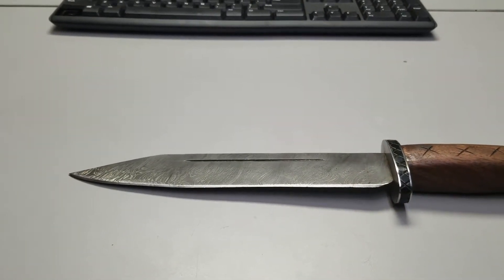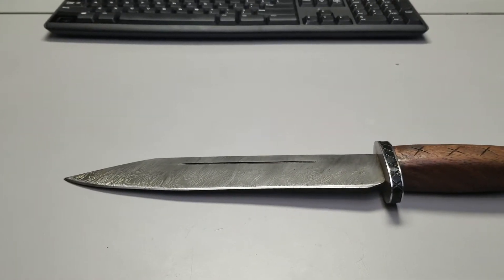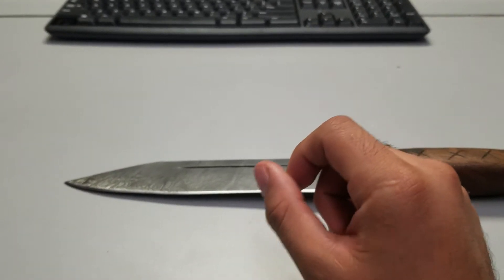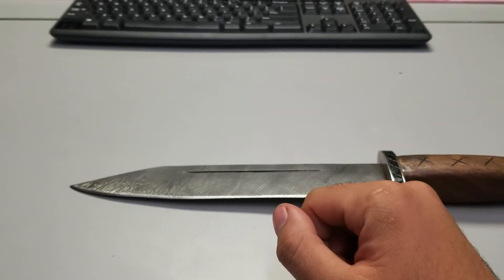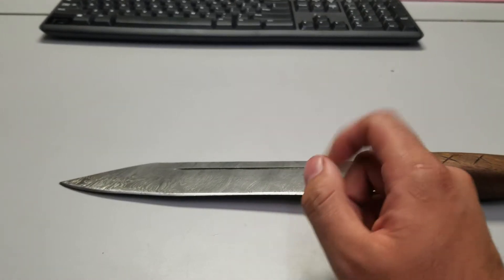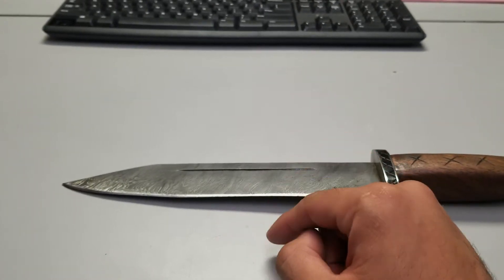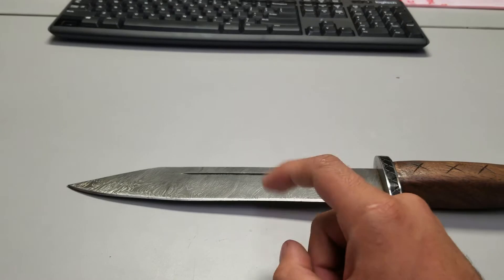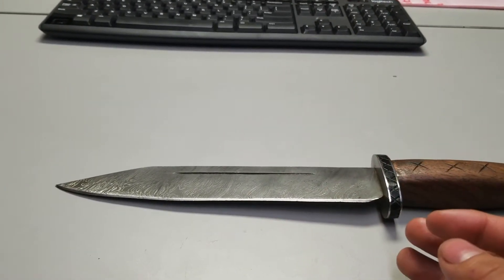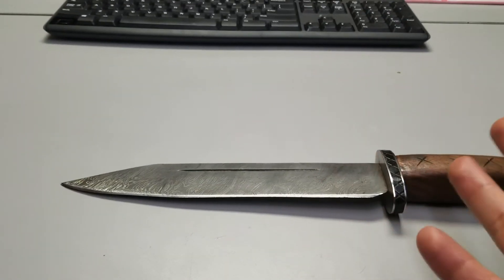Another explanation is subpar forging techniques that left cracks in the blade. On the surface it'll look like a very small hairline crack, and if you polish it enough you don't really see it — but if you grind away and investigate that piece of metal, the crack could be significantly wider and deeper on the inside. That's another case where the sword or knife was just made poorly, and that's why the better-made one broke it — it didn't really cut through it.